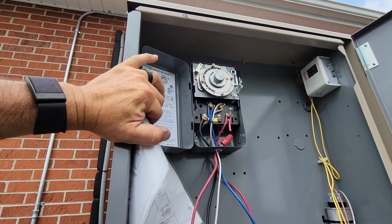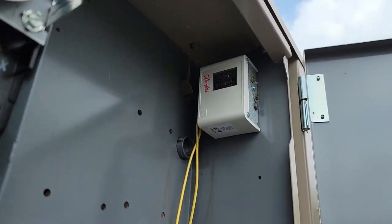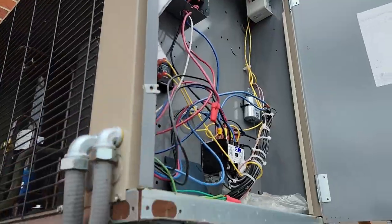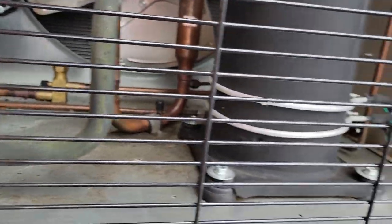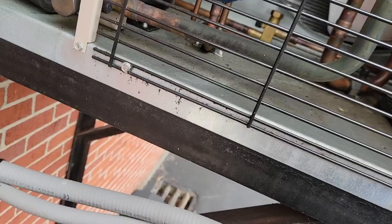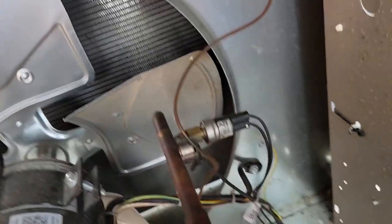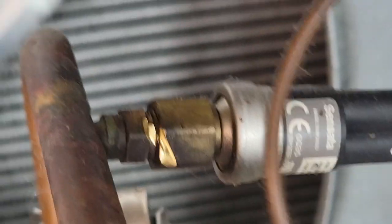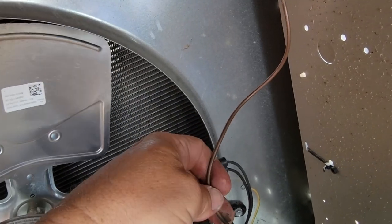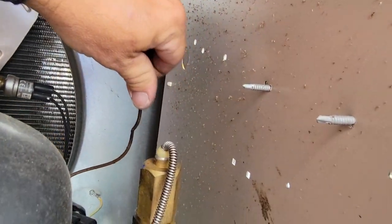It's not in the middle of a defrost — that's good. Where did that leak come from? Do we have any leakage around that little stem there or is it over here somewhere? Hopefully it's an actual new leak and not some leftover crap that somebody left in there. I have never been here before so I don't know what it usually looks like. That doesn't look good from what I'm seeing. Look at that — not good. Got to watch out for things rubbing against other things. Looks to me like the line was rubbed right in the middle.